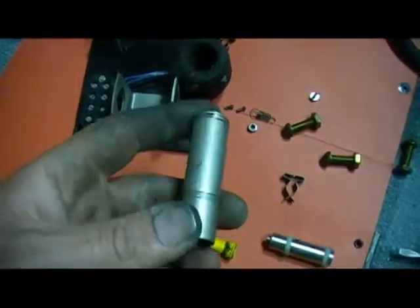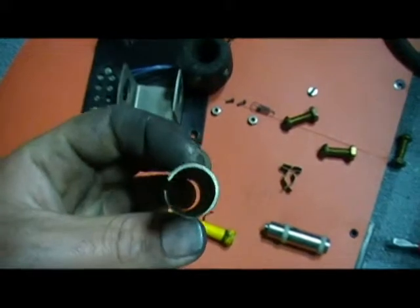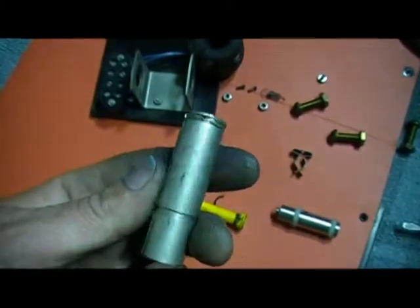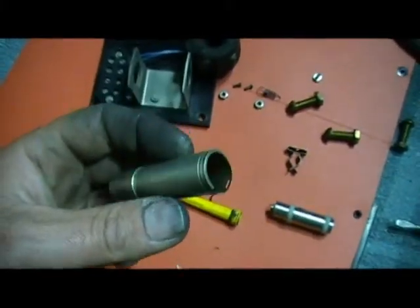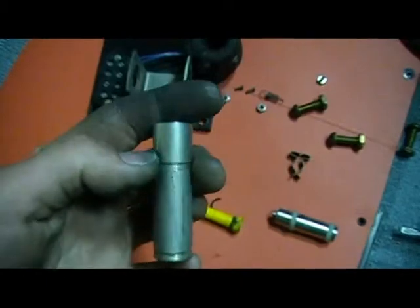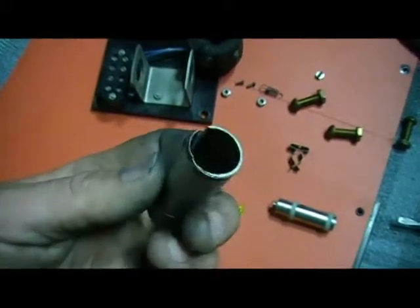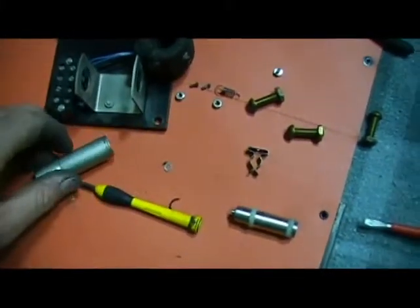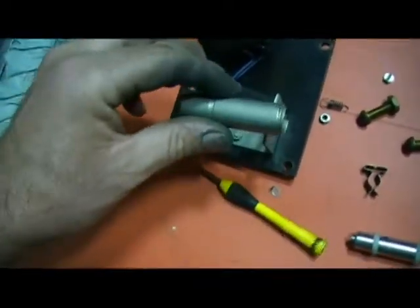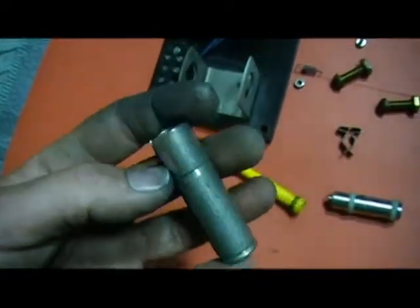Most of the ones I come across that are mercury have a slightly different arrangement. It wouldn't be too hard to make something like that, but the relay will operate 100% now with the new washers. So I'm just going to clean this up and put it back in. I can't reverse it because of the grooves, and I can't rotate it because this slot locates into a key which screws in at the bottom. So I'm stuck with the way it goes in — we'll clean it up and I'm sure it will work fine.